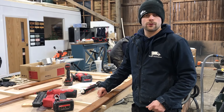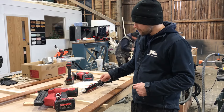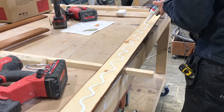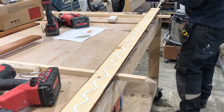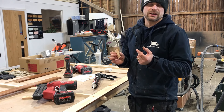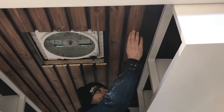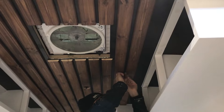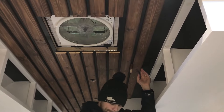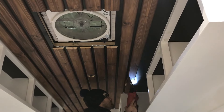I'm about three quarters of the way through installing the slats into the ceiling. The method we use: we run a bead of Fix-All adhesive along the back edge of the slat, fix it up in place, then use a couple of 14mm packers just to ensure the gap between each slat is even. The final part is to use a nail gun with a 32mm brad nail, firing it through the 6mm baseboard and the 12mm plywood strips below.